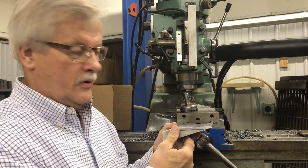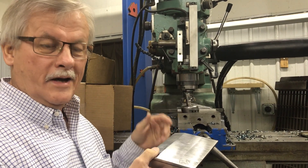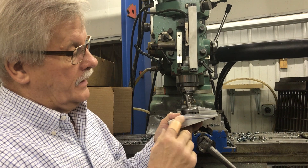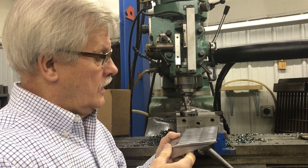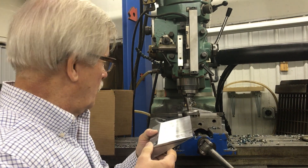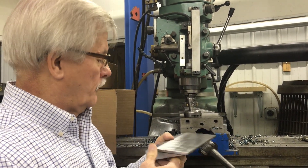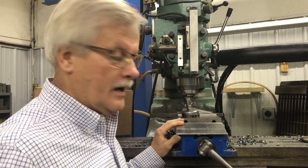I squared up the blocks so they're nice and square, and now I've got my vise here which holds accurately. I've set my other block up there on an angle. I've got to cut a 14-degree angle on both blocks so they match together. I've taken a pretty hefty cut here and I just wanted to show you how the cut's going. But before I do that I'm going to tell you about the cutting technology that we've got today.